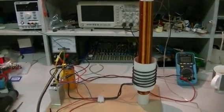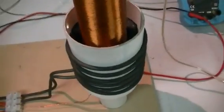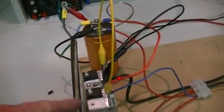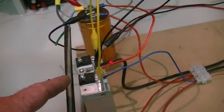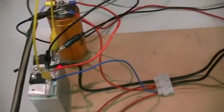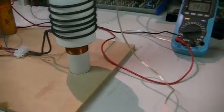So how's our little setup at the moment? We have our tower, our primary which can slide up and down the tower to tune it. This circuit is being run from the TIP35C's — two of them — they will handle 100V, but we're only running at 24V at the moment. This is the Slayer circuit in giant mode, overdriven, with an air core tower.